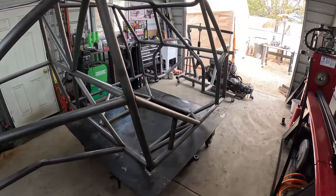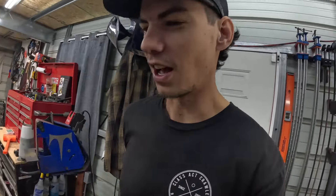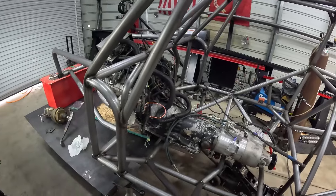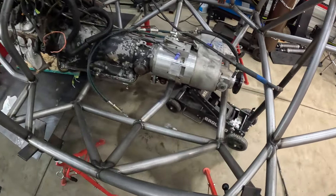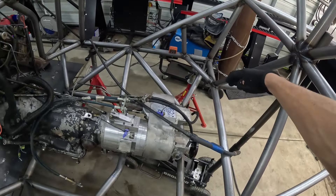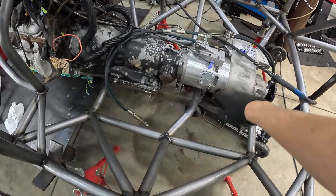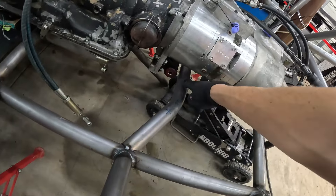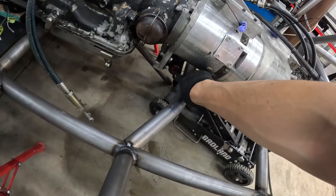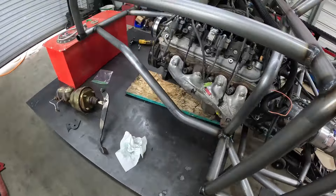Got the motor back out now and I'm about to finish weld this chassis. New haircut — but yesterday I got the chassis all finish welded out. Like I talked about, I added gusset tubes to all these corners so these tubes aren't dead tubes, and then added the transmission crossmember. I'm just going to do simple tabs going to the old mount that he had in the FJ, and then start working on motor mounts.